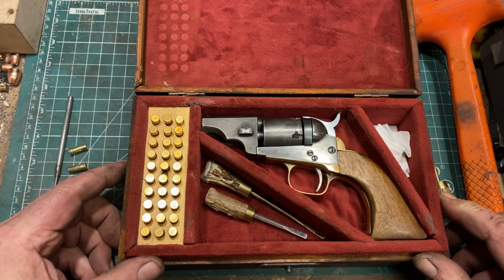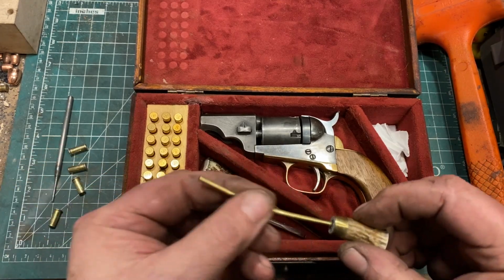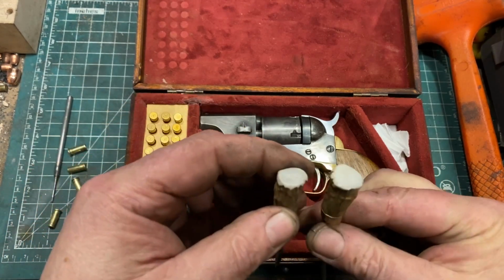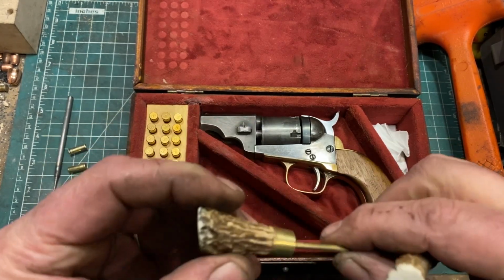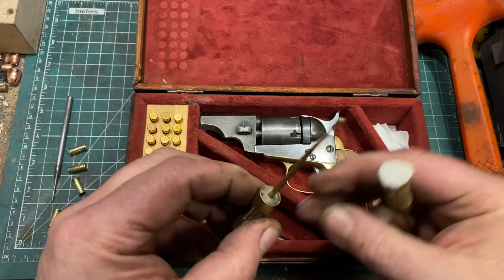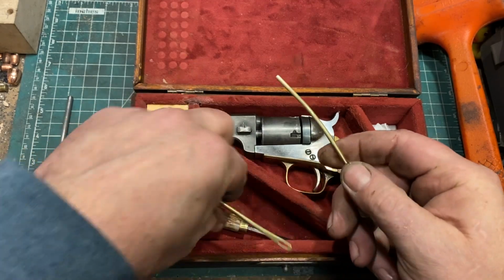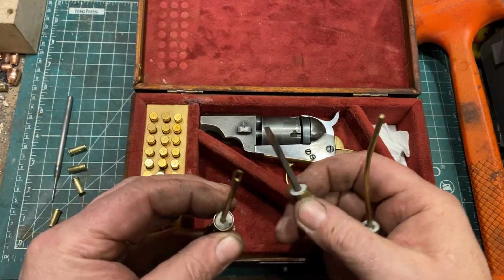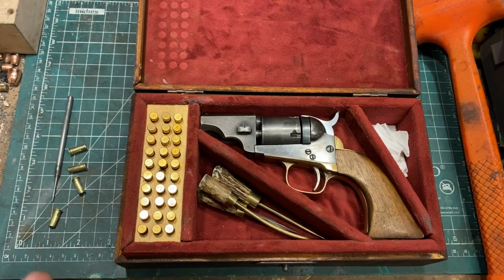It's just interesting to me, and it's kind of neat to do all this work yourself, like all these pieces with the different chunks of antler that was too small for knife handles. So I actually did find a use for it here. And the ferrules on these are actually just cut sections of cartridge cases of different calibers that were softened and fitted and glued into place. So it makes a really neat, handy little kit and a conversation piece.